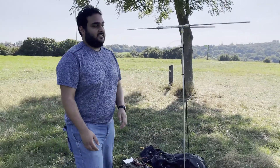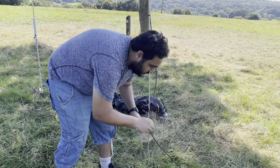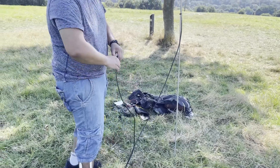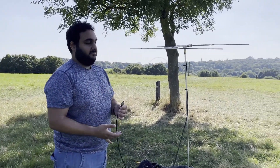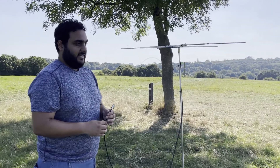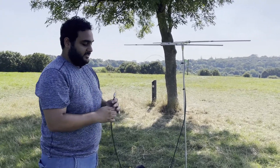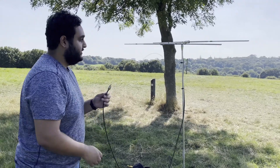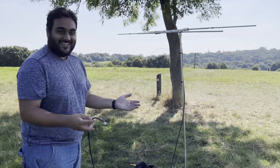It's just below head height. I have a short length of coax cable which I'll either attach to my handheld or my Yaesu 857 if I want to do sideband. I've got a little neck strap for that — I wrap the Yaesu around my neck and this goes into the back of the rig. 20 watts out, no problem. This antenna can handle up to 50 watts. It's a great antenna.